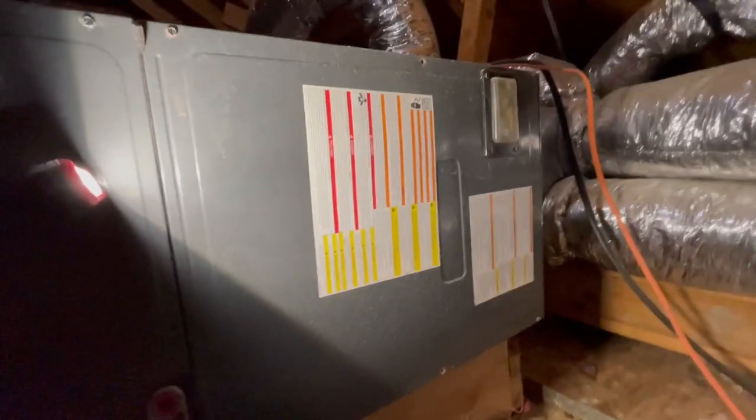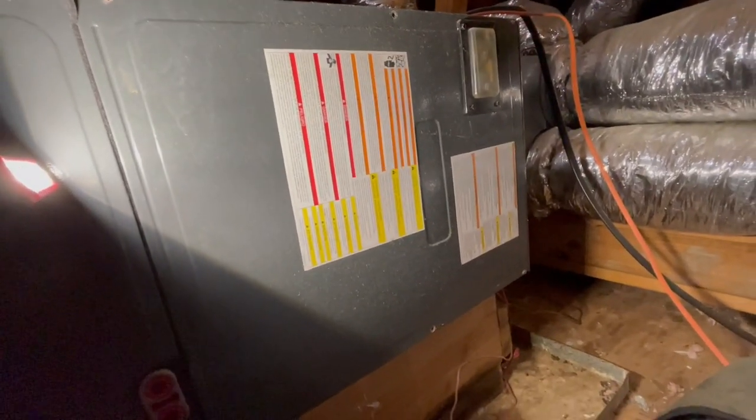Let me get this thing opened up. They forgot the two screws in the middle — Goodman has six screws, three on each side. A lot of guys when they lose screws leave the middle ones out, which I mean that'll work. ICP only has two on each side, one at the top and one at the bottom, but Goodman makes a pretty big air handler.